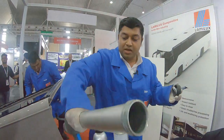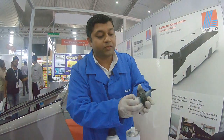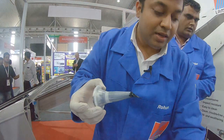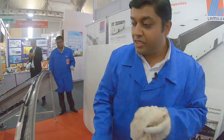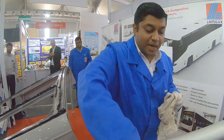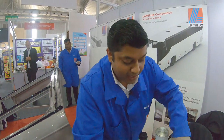Using cartridges reduces wastage of material — the whole cartridge is used, making it more economical than the current 300ml cartridges. As you can see, the adhesive has been applied in a uniform manner and in a proper proportion. The next step is placing of the GRP.